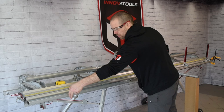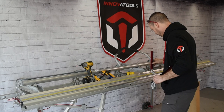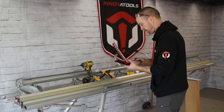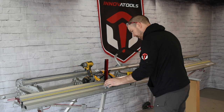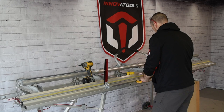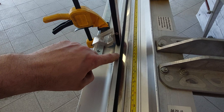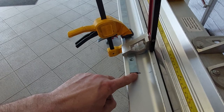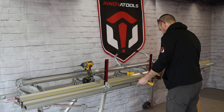Put one bar close to the middle of the brake and take the two brackets to line up. Loosen the adjustment all the way to the back so it doesn't interfere, then latch them onto the brake — this guides the height you need to set the bar. You want it to rest just flush with the top aluminum so it sits just underneath the rubber. Clamp down one side, confirm the other side is good and centered with your line — that's where you need to install it.